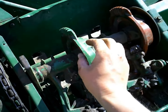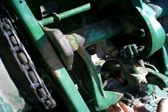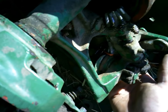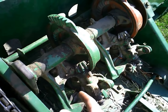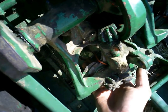This piece has been replaced, and this one has a little bit of a groove worn here, less than this one. The bill hook — you can see it's got a little bit of play in it, moves back and forth a little bit, and this one moves back and forth a little more than this one. But this one was a lot worse — it was about a quarter inch that could twist from the tip of the bill hook. Now it's only about a sixteenth of an inch.